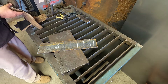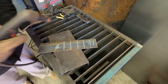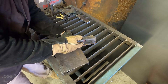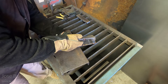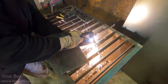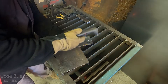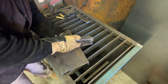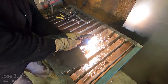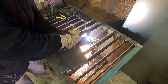Here I'm getting prepared for my first cut. When you're cutting with plasma, you want to make sure that your torch is over the edge of the plate that you're going to be cutting — very similar to oxy-fuel cutting. We want to have the torch just over the edge so that when the arc is established, it doesn't just gouge into the surface of the material outside of the path we're actually cutting. We want to start the cut on the edge, and then bring that cut into the plate along the path we want to cut.